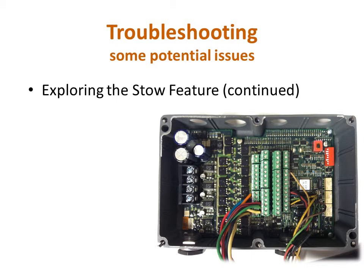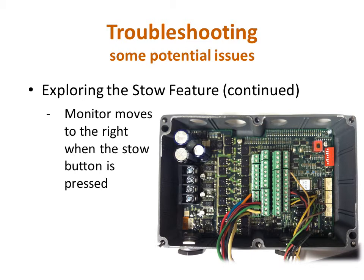If you press the switch to stow the monitor and it rotates instead of stowing, there are two likely causes. If it only rotates to the right as long as the stow switch is held, check to see if you have a 6-wire stow controller—which will be missing wires on pins 7, 8, and 9 of TB1—and then make sure that dip switch 1 is in the up position. If it is down, the logic board does not recognize the combination of fog, stream, and rotate-right commands from the controller to signal the stow command, and treats it as a command to rotate the monitor to the right instead. On the other hand, if you momentarily press the stow switch and the monitor rotates all the way to the hard stop, then the sensor has not picked up the magnet and the sensor and wiring harness will need to be checked for damage.